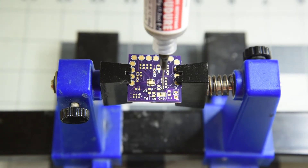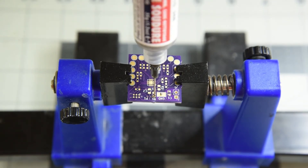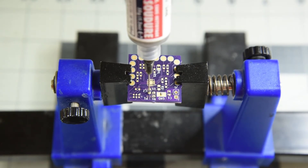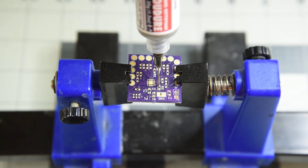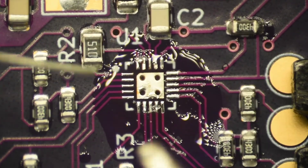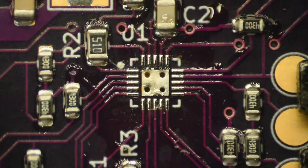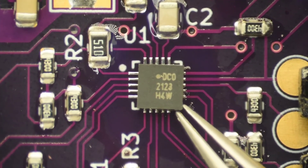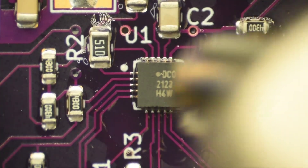For the bigger SMD pads I really like the way the solder paste works — would like a way to put it on a bit more evenly, but it doesn't seem to be too critical about placement or amount. For the fine pitch pads, it's not going to work applied by hand. I'm really glad I tried the solder paste; I think it might end up being my preferred solder for SMD devices as long as the pad is large enough. For the no-lead IC packages, I think applying solder to the pads with the iron at as low a temperature as possible, trying not to touch the thermal pad, wanting as much solder on the pads as possible but very little on the thermal pad, then reflowing the solder — and possibly using solder paste for the thermal pad — then getting the IC aligned, I think if I do those things well and apply the hot air, I will have a successfully soldered IC.